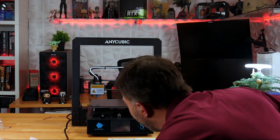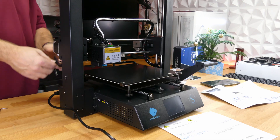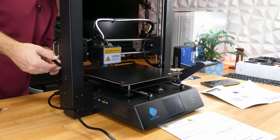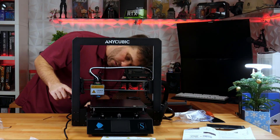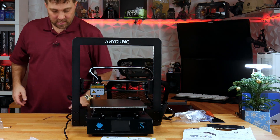That's my first issue. This cable for the motor on this side actually got pinned between the end stop switch and the motor, so it made this side's motor stop while the other one kept going. Let me free the cable and try that again.